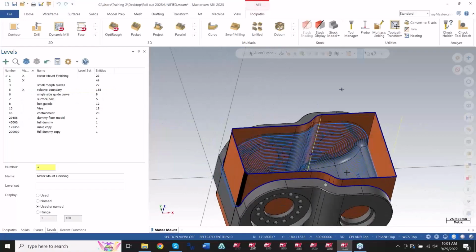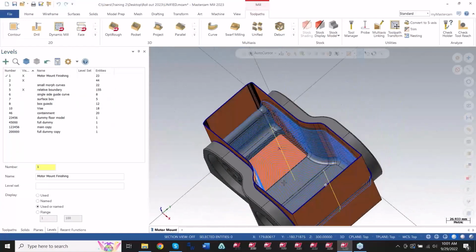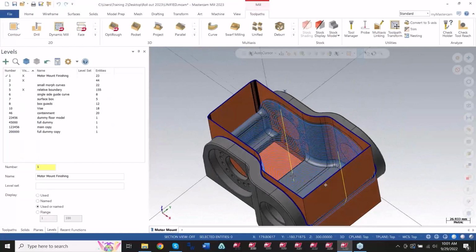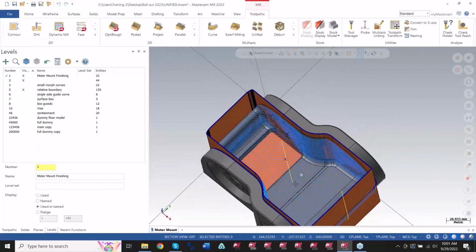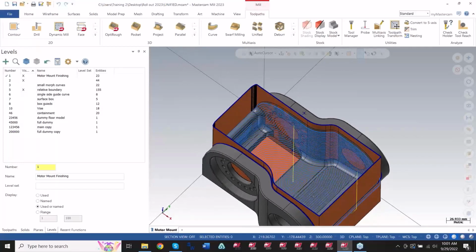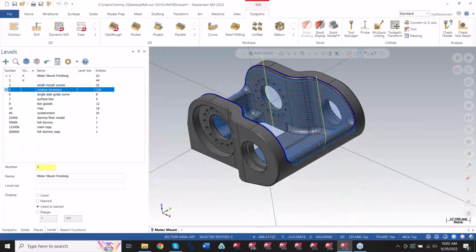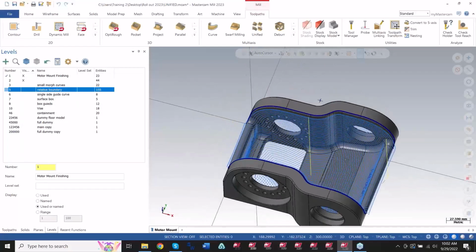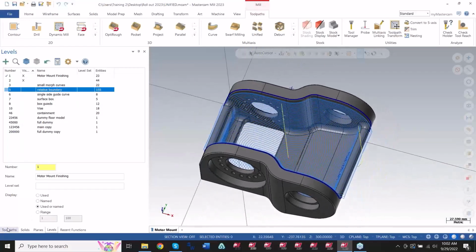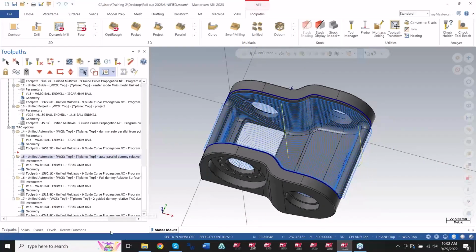You can see I've got a generic shape of a box matching the overall profile. So I'm saying stay normal to all these faces with some axis control limits, and I can walk across the entirety of this part without any issue of over tilting and overextending these sections here. I've got a better example for this one, so let me bring that in now.